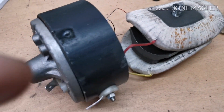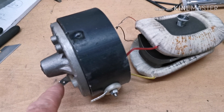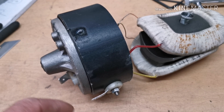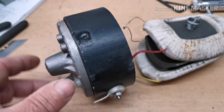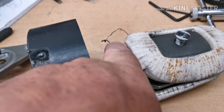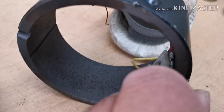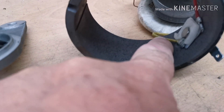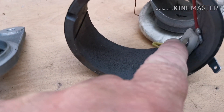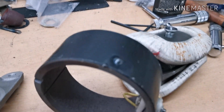I'm going to start sorting out the brushes now. Before I start I'll just explain what's happening on the original car generator. These two spades are your positive and negative power. If I take that off you'll see the coils - each coil is joined together and these two wires, one from each coil. This wire from one coil is insulated from the other wire, which is earthed against the body, going through that bolt head through to the spade. I've drawn a little diagram - I'll show you.